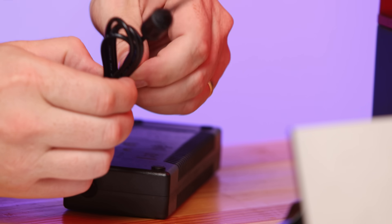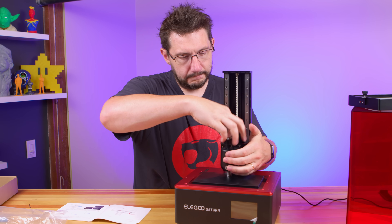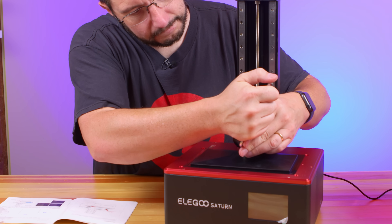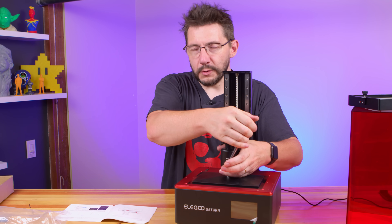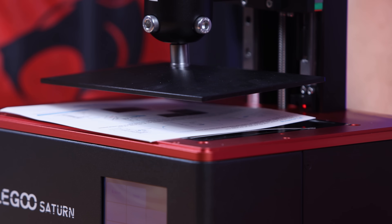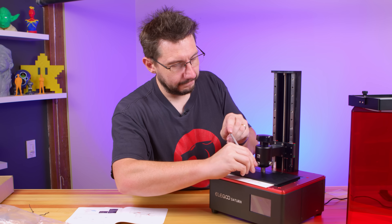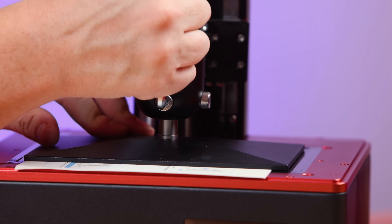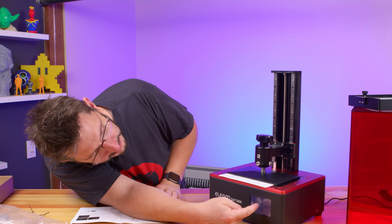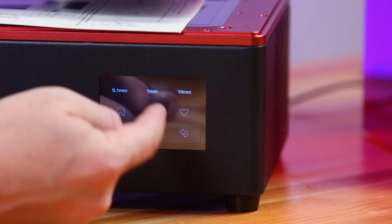It is good stuff. Connect power cable to printer and power supply. Insert the build platform, fasten rotary knob, and loosen the screws. I just want you to know these screws and loosening it — it's a very satisfying feel. Remove resin tank. Put leveling paper between the build platform and the 2K LCD screen and click move Z-axis to zero. Fasten screw one first — that's this bad boy right here. Now it wants me to make the Z-axis go up — if I hit that button 10 times, it'll move it up 100 millimeters, 10 millimeters per touch.